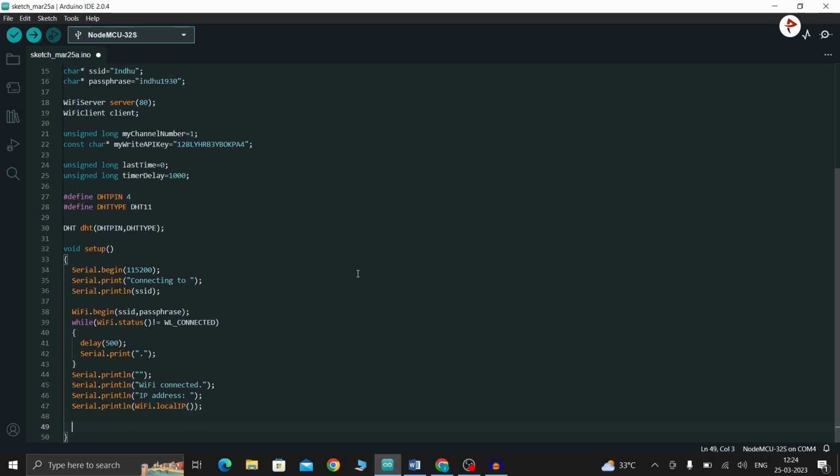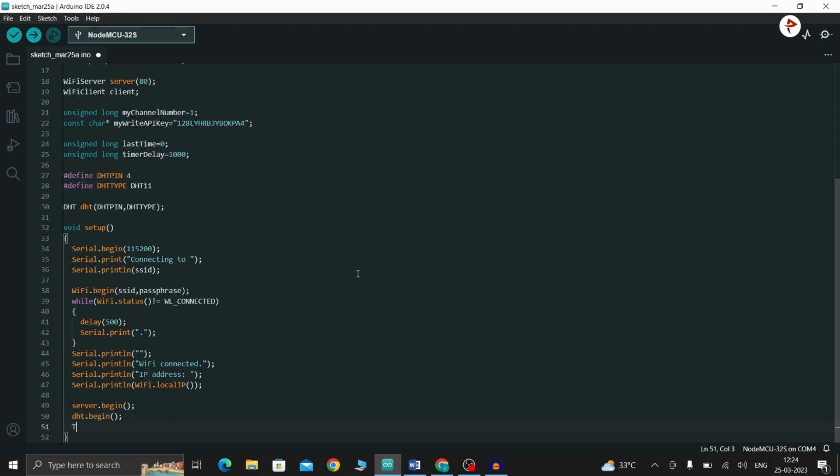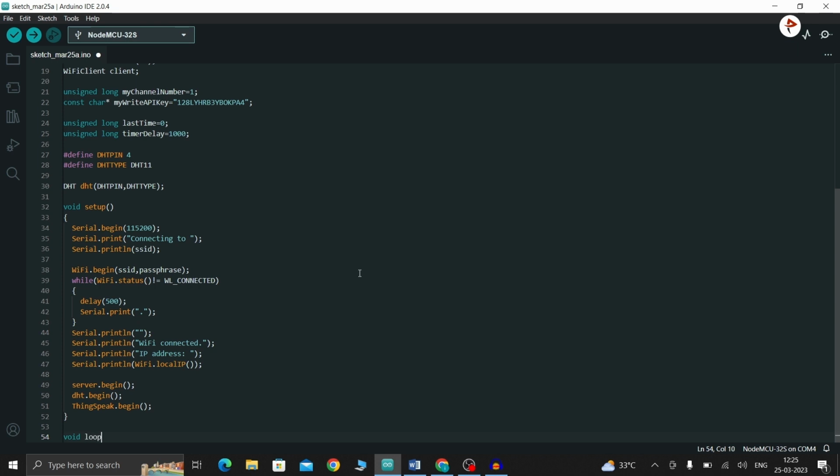That's it. Now I'm going to begin the server. So server.begin. Now DHT.begin, and I'm going to begin ThingSpeak. ThingSpeak.begin. So coming to the loop.